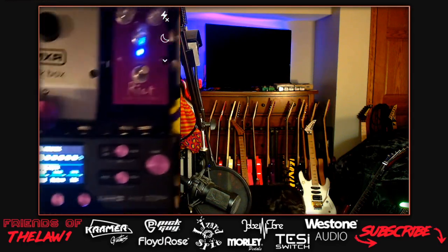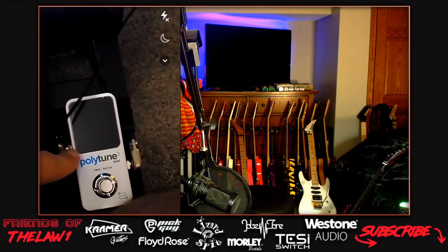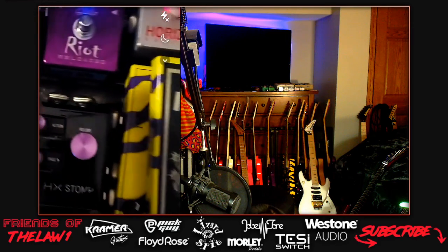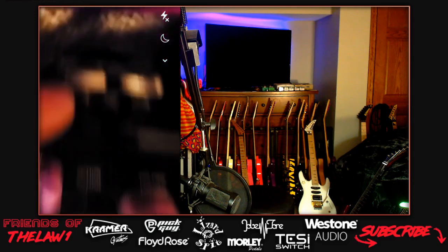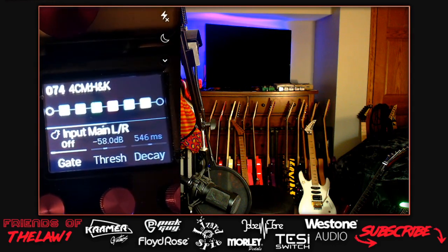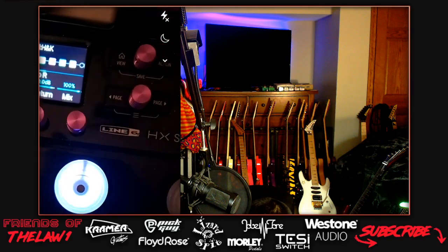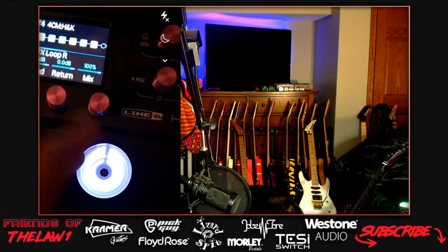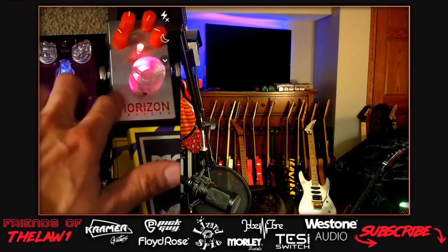But anyways, in my application, what I'm doing here is it's this to this to this, which mutes your signal for tuning, to this and to here. It's your left mono in. Comes in to your Stomp. And then your effects loop right block, which is my main distorted tone. When I want to use clean, my amp is set to clean by default because this stack here is providing me a distortion in this case.